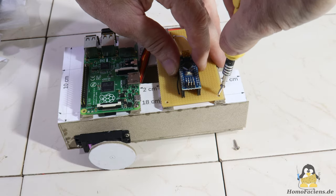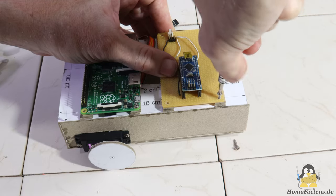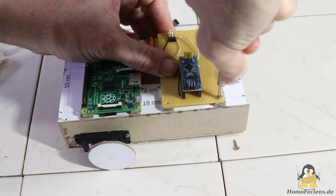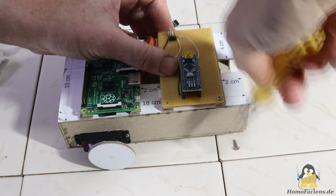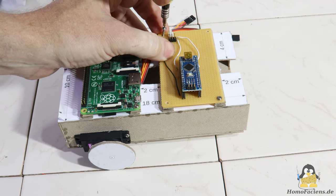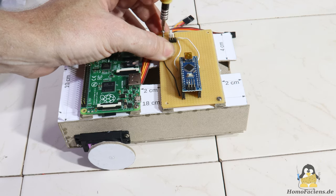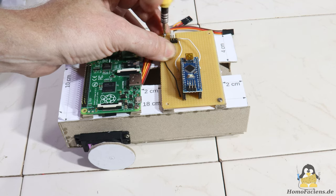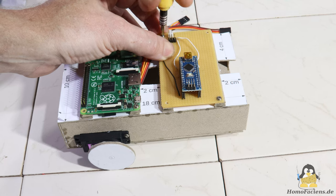Here I installed a cheaper nano board with an ATmega328 microcontroller. An ATmega2560 board like with R20 can of course also be used; however, to my mind the smaller and cheaper board is the better option for a cardboard robot. For the electronics, which in the simplest version consists of pin headers for the servos and a few resistors, I use the prototyping board that still has room for extensions.